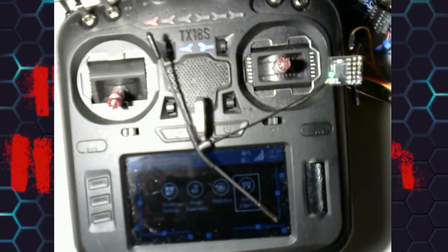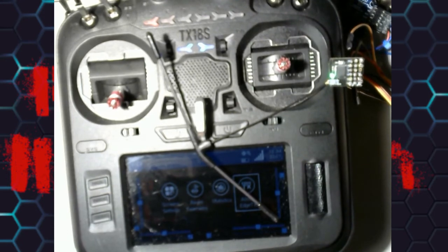So that means that the stuck in boot mode problem on these receivers is due to bad firmware. And the solution is simply to ground P1 to ground, power it up, and then flash it through a Silicon Labs device like the CP2102 I've got. You can either use that one or you can use the FT232R or something like that, which will work too. You're going to make sure you've got the drivers installed for that so that Windows recognizes it, or whatever operating system you're using. And then just flash it over UART with ExpressLRS Configurator. And your dead receiver should come to life.